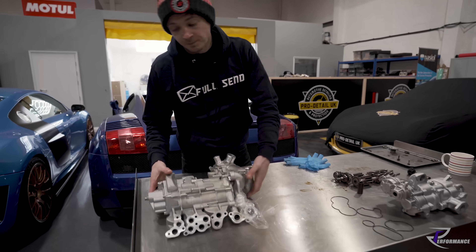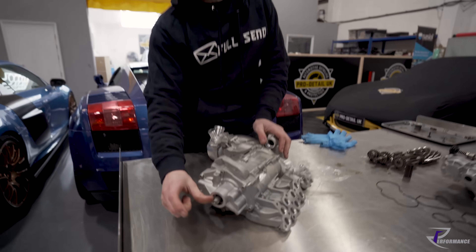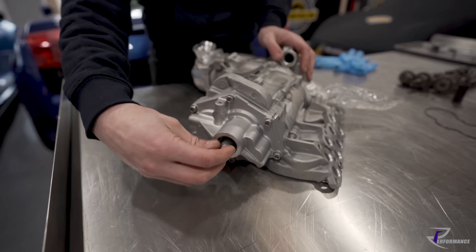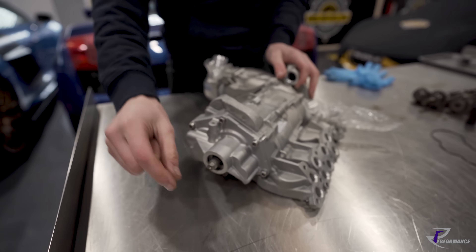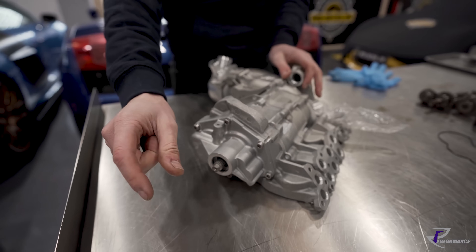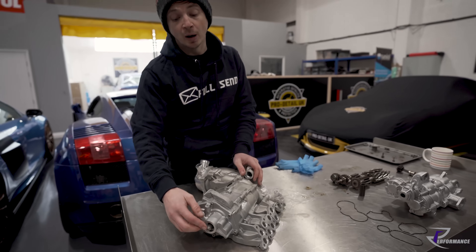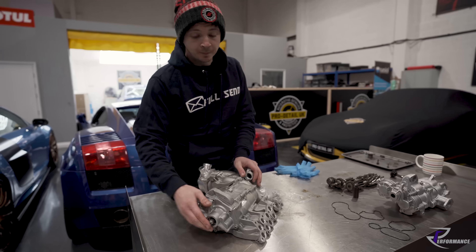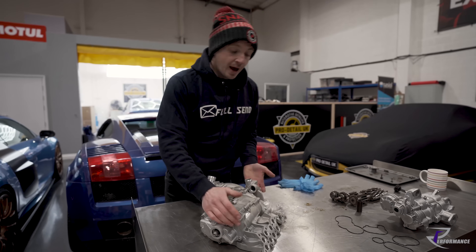The only thing we do see is where it joins - it's like a tube with a drive shaft that joins the back of the timing cover - and that timing cover seal, exactly like the old V10 RS6's, leaks. The seal goes like plastic and you get an oil pump drive seal leak. We do quite a few of those - a couple a month.